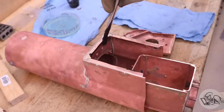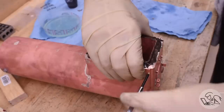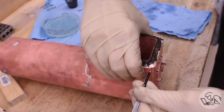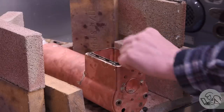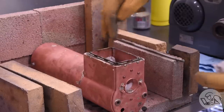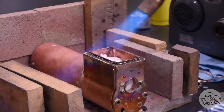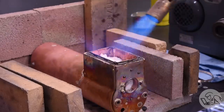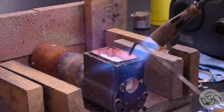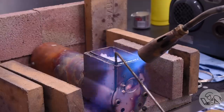Final check with the back head and things are looking good — I think I'm ready to attempt to solder this joint. So once again, flux everything and get it all set up on the hearth with little pieces of solder all the way around. There are also some fixturing ring screws that hold the back head in place during this operation. Note that we're soldering the foundation ring all the way around, so the back head will no longer be removable from this point on. Having learned my lesson on that throat plate, I stuffed some ceramic wool down into the firebox to protect all the inner joints from getting too much heat while I do this. This joint seemed to go well — I got it hot enough, the solder started to flow, and I worked my way around from one side to the other, flowing the solder as I went, in combination with the scratch rod to push that molten solder around and make sure I get a good fillet everywhere.